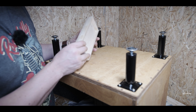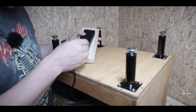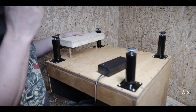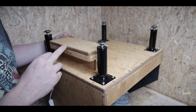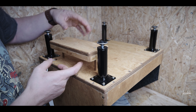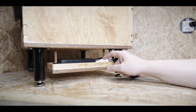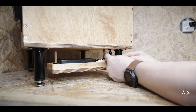Off camera I built this basic wood box where I can put the power supply and cables if there are too many cables coming out of the main box. I glued these wooden sticks and will glue it in place. Teak oil before gluing is not a good idea — this glue doesn't stick if there's oil. It's not a problem; I secured these with small screws that should hold it in place. The power supply goes here, the switches here, with easy access, and all the cables come out from one hole.